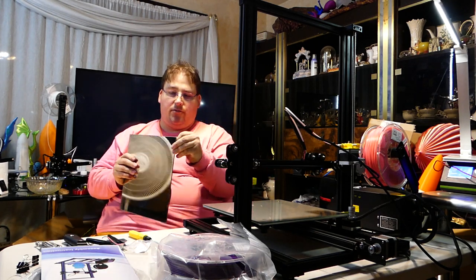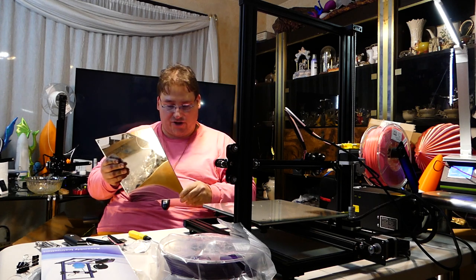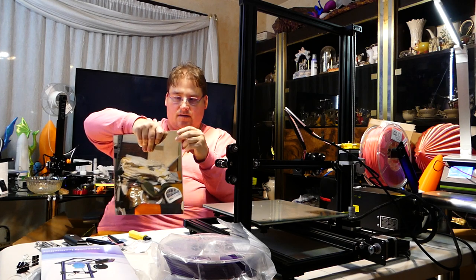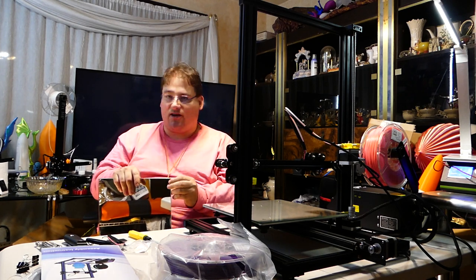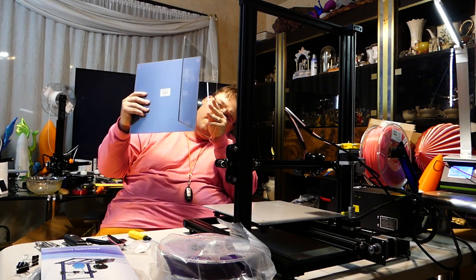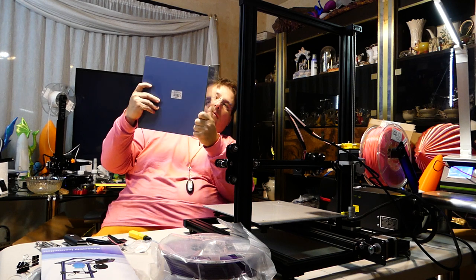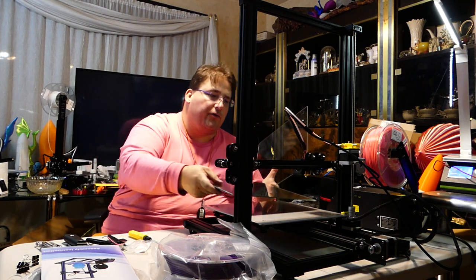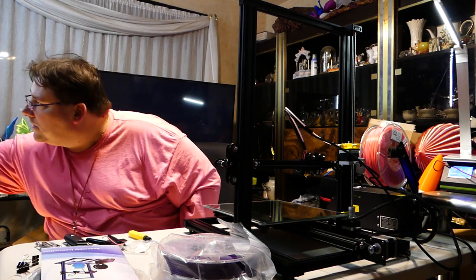Now, depending on which one you get, don't forget to remove the little rubber feet on the bottom of the glass, because otherwise it won't actually be touching the aluminum plate and you won't get good heat conduction. These are available for $9 on Amazon. I'll have a link below. If you want cheaper and you know you're going to need a lot, although it's a lot thicker, you can get a 6-pack for $10 from Home Depot. They're not as nice, they're not as clean, but they're just as flat. Well, I don't know if they fixed their quality control, but I can tell you that the glass pane that came with this one is perfectly flat on both sides, so this is a good piece of glass. Which means I'll be hanging on to that.